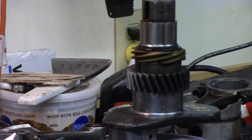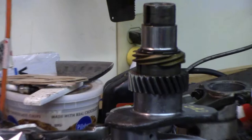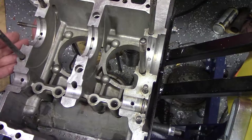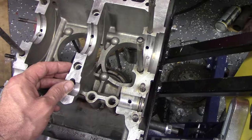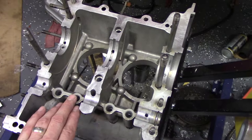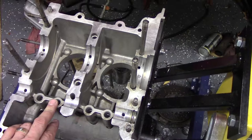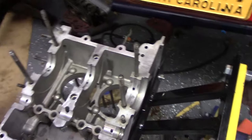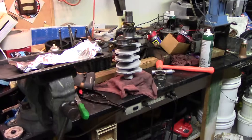We will let that cool. I'm going to be done for tonight. So what we will do next — we'll get this all wiped out, lay the crank bearings in there, put the case halves together, and we will attempt to use the dial bore gauge to see what our bore looks like. We've mic'd the crank and we are spot on there, so we'll get that all laid out and make sure we're good. Then we will start putting this thing back together. Nice frosty crankshaft over there.